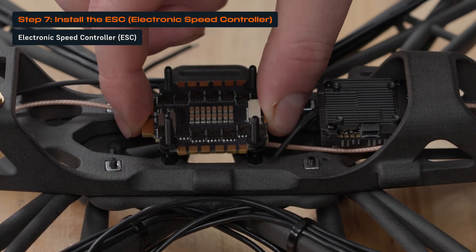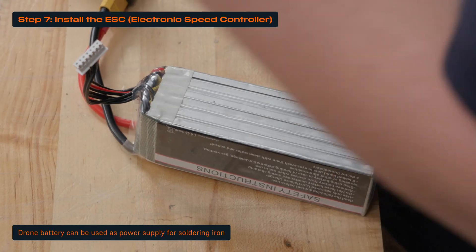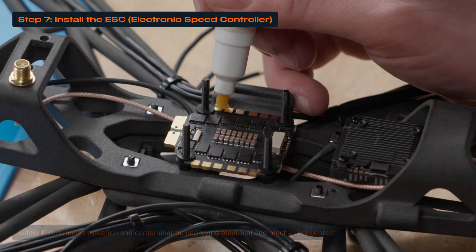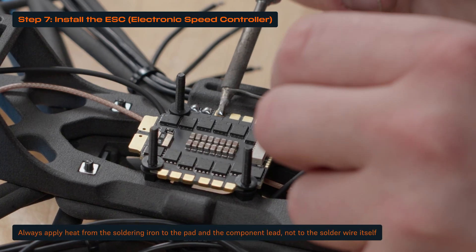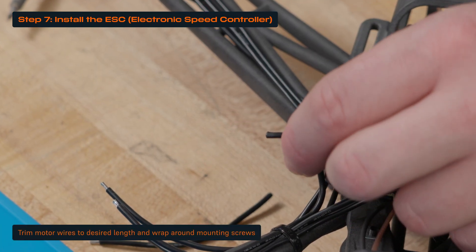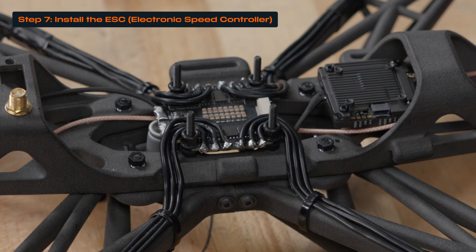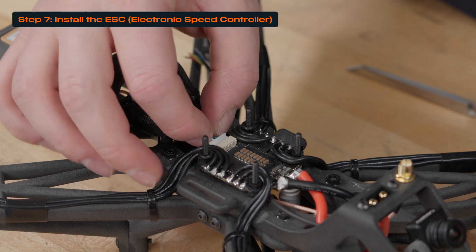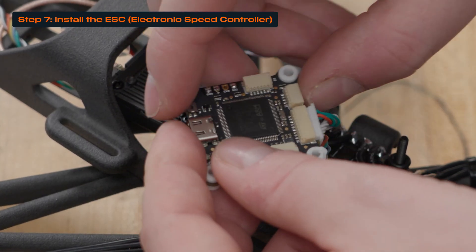Mount your ESC with the main power pads towards the front of your drone. This drone build was designed to be field serviceable, so your drone battery can service the power supply for a field soldering iron. Before soldering, apply a little bit of flux to the pads to ensure a quality solder joint. We'll be using around 380 degrees C with a chisel tip. Add solder to the desired pad — always apply heat to the pad first, then add the solder. Trim the wire to the desired length and wrap it around the screws for better organization, then apply the tinned motor wires to the pad. After completing motor wire soldering, prepare the cable connecting the ESC to the flight controller, ensuring the connector properly attaches the correct pins of the flight controller to the correct pins of the ESC. Once the cable is validated, plug it into the ESC connector and leave it there.